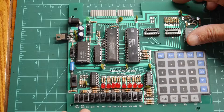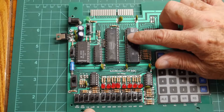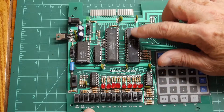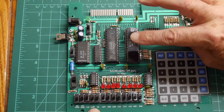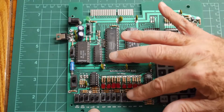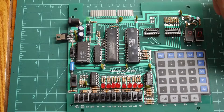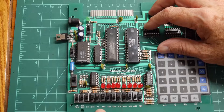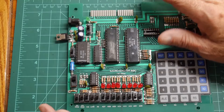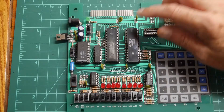Reset. Enable ROM. Enable RAM. TIM, which is probably the timer, and enable the I/O timer. I/O slash not memory. So you can either set the address for memory or set the address for I/O. The address counter only goes up to 8 — 0 through 8 — that's all you get, because it's 256 bytes of RAM in here.